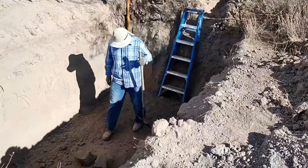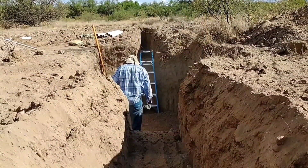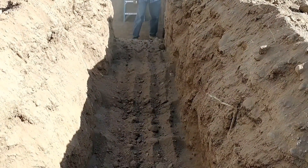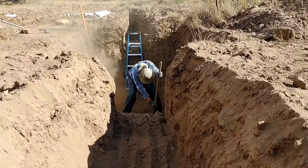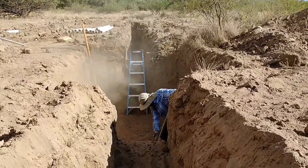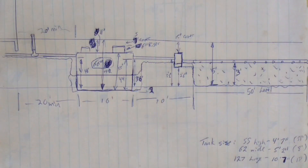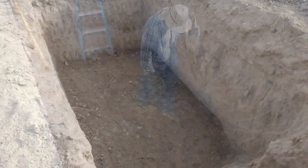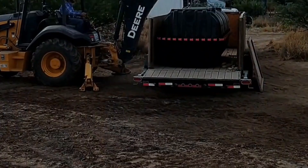I found out it's critical to get your elevations correct in relation to each other. The elevation of the septic tank relative to the leach field is a critical measurement — I had to sit down with paper, draw it all out, and figure out exactly what it needs to be, because you need to be within a couple inches of exactly the correct elevation. When I dug out the septic tank area, I originally went about four inches too deep, so I had to backfill by hand, wet it, compact it, and get that elevation just right before putting the system together.